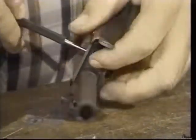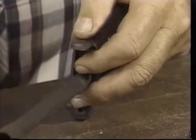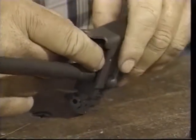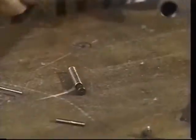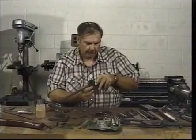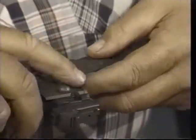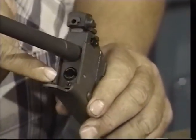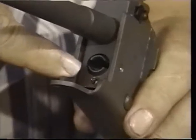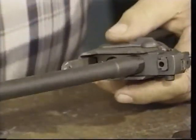Now we have the plunger under spring pressure. Now we're going to remove slowly so that it hits our finger and doesn't leave too bad of a blood blister. Okay, now because you can see that's a fairly strong spring. Okay, now the plunger, you'll notice it's still not wanting to come out. Okay, the plunger is attached. There is a tiny screw at the base here which we need to remove in order to pull the latch itself, so then the plunger will come out.